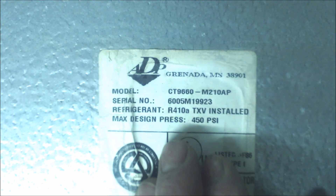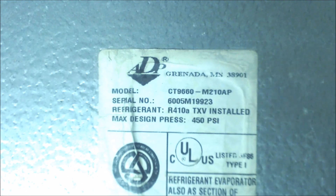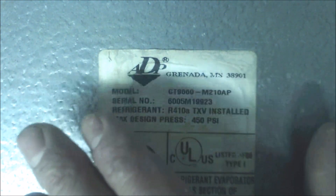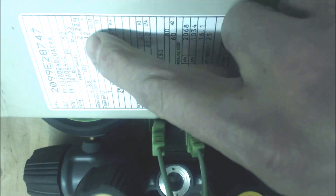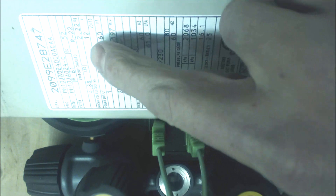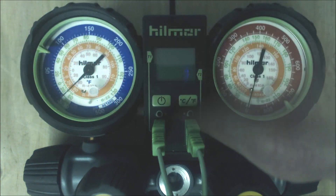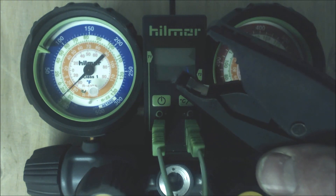It's just a matter of what the installer had. So this one says TXV, but I would open the cover up and verify that you actually have a TXV or a piston. Once again, if the outdoor unit says R22 and it has a TXV, we know that the target subcooling is 12 degrees. So we would put a temperature clamp on the small liquid line.